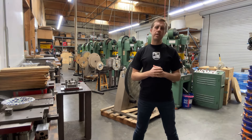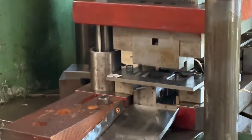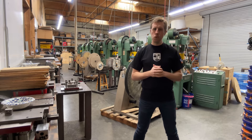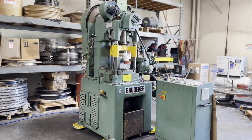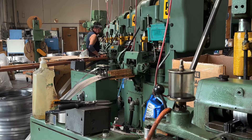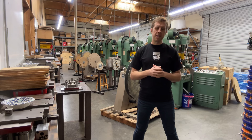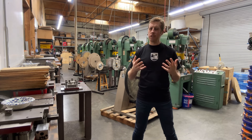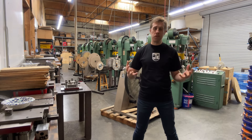Skill number three: understanding the basic function of a stamping die. This is the most obvious skill, but I still have to mention it. For those who don't know what a stamping die is, it's basically a tool that cuts and bends sheet metal into a finished part. It has an upper half and a lower half which get mounted in a punch press, which provides the power for the stamping die to cut and form the material. A tool and die maker should be expert at performing maintenance, adjusting components, knowing how each component functions and fits together, and also building a die from scratch.